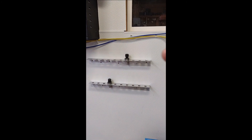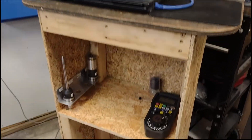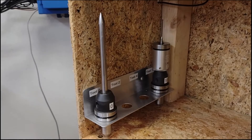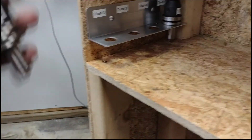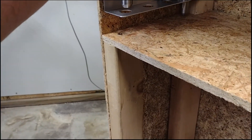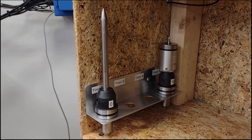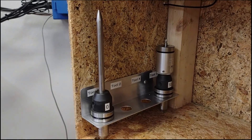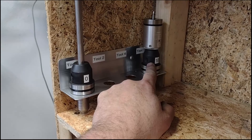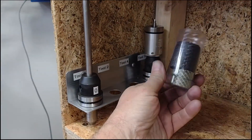I went ahead and made up the tool holder holders for the Tormach TTS tool holders. I have two rows on this side with 10 positions, and on this side two rows with eight tool holder positions. Over here on the computer podium, these are for my non-operational slash test tool holders. This is tool zero, and I'm following Acorn's guidance making this the longest tool in the bunch. I had some leftover 3/8-inch stainless steel, so I put it on the lathe and made a tip on there.